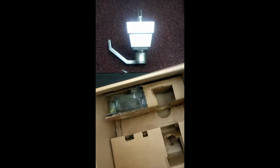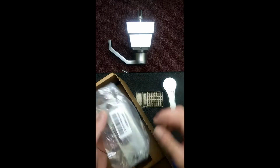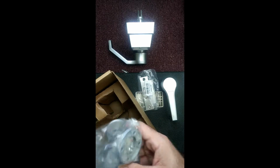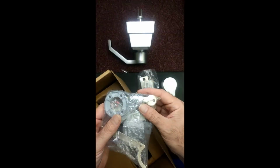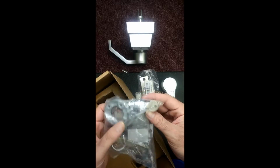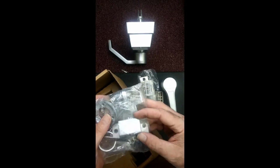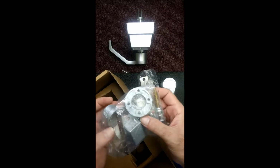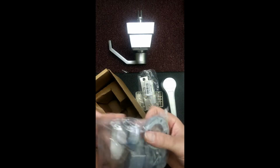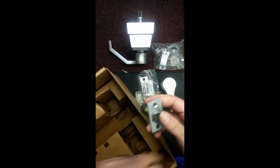Side lever, and you have the strike packet. That's a normal 4 7/8 inch strike. Kind of accessory mounting packages. Here you'll find the faceplate cover screw, along with your, what are these, DF59 keys, strike box. This is a spacer plate in the event of a thinner door, the threaded collar, and the latch bolt.